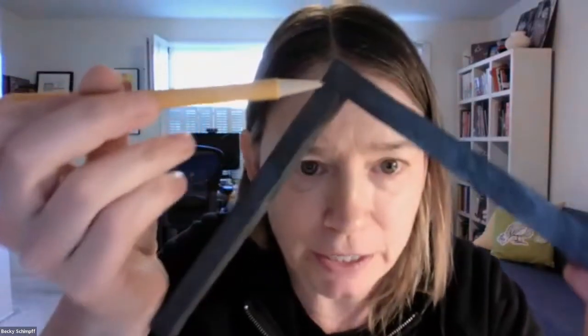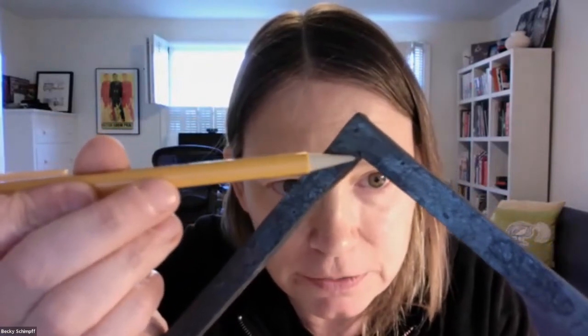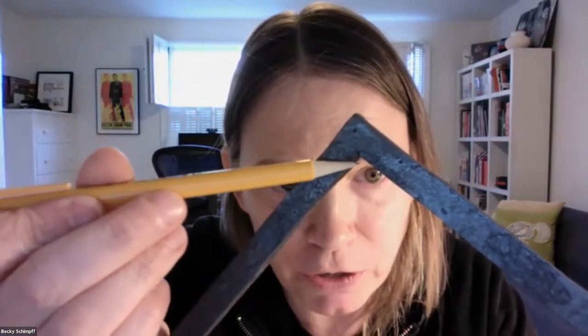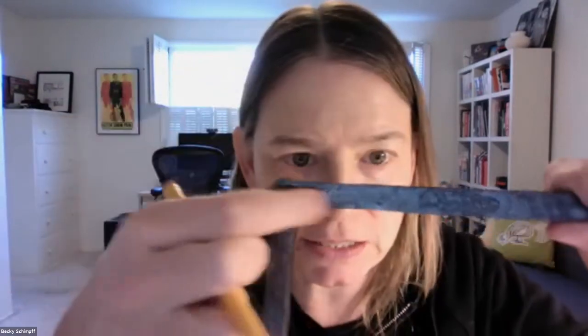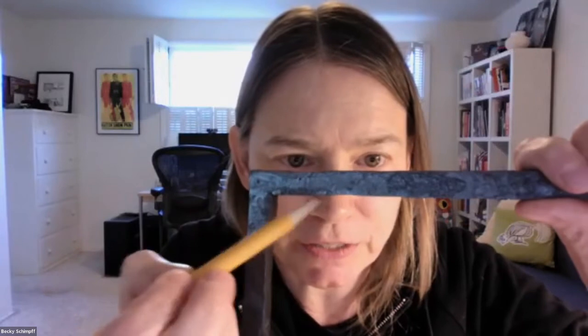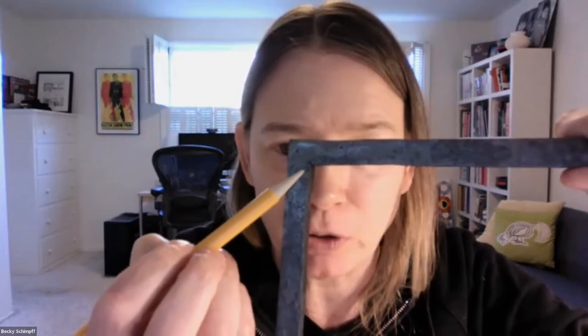Okay, so no, it's only that 90 degrees. And I don't know if you guys can see this. Just for the purpose of this presentation, I made a sample bar where I forged it right at 90 degrees. I don't know if you can see it, but there's that crack. The material is folding over in on itself, and that's because with this angle, the material in here is becoming square before the outside is square. So you get a really clear fold right there.